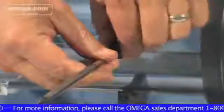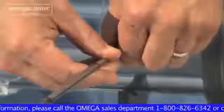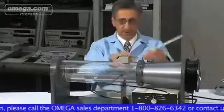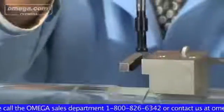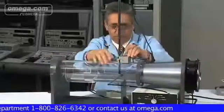Installation is important with the WTM-1000. The owner's manual has clear instructions. When installing the wind tunnel, be sure to have ample space — 5 feet minimum — on the front intake and rear exhaust of the tunnel. In addition, ensure it is placed away from open doors, windows, or AC vents that could induce wind drafts on the wind tunnel.